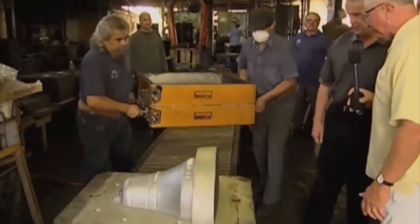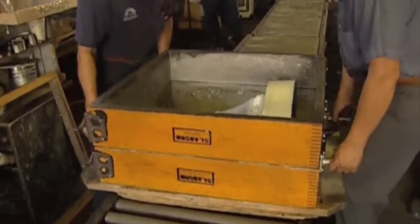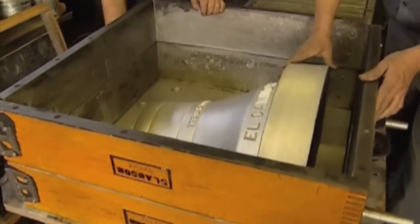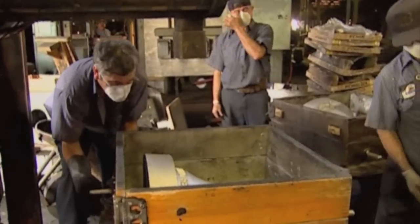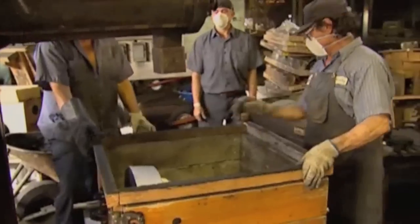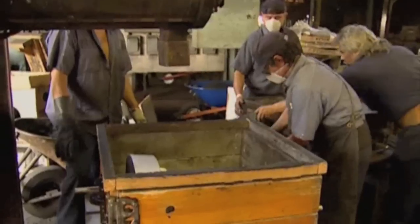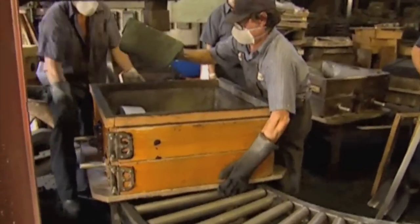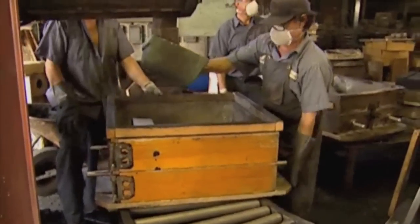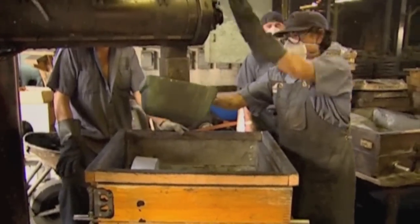Making bells — this is very interesting. I've never seen anything like this. It was made in two halves. They put a box around the pattern and they filled that box with sand; it was chemically bonded. And this is basically being done the same way they would have done it back in 1906. It's a sand casting. The bonding agent might be a little bit different — they probably used green sand with a clay and water bond, and this is a chemical bond. A more durable, stronger mold, but basically the same process.